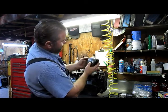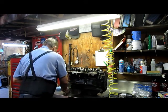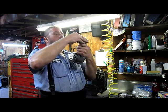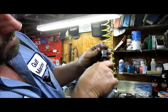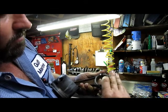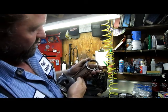You can see the scoring in it. Now, when I was saying before about how these come apart and go back together — you look at this edge where they match together. It's split right at that point. If you can't tell how it goes on this way or that way, if the split is more straight, there are two index tabs right there. You line your index tabs up, you know you're good. That's how it goes back together.